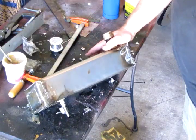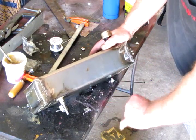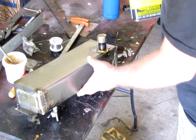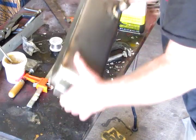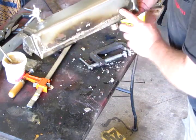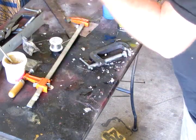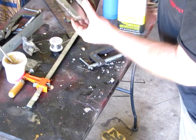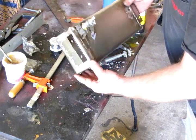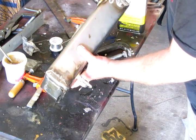I went back through the tank, I touched all the seams up, double-checked it, and tested it — we don't have any leaks. I'm taking some denatured alcohol, pouring it in there, giving it a good shake to make sure the denatured alcohol gets in the areas where your seams are. Slosh it about a good bit. Still keep checking for leaks. You could have some small ones and still be okay because don't forget we're going to use the Caswell tank sealer on it.